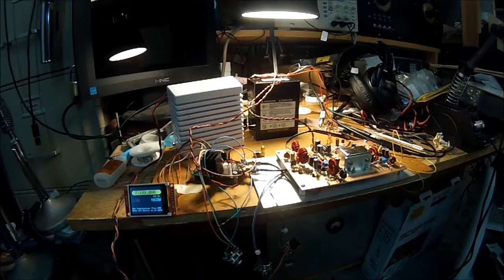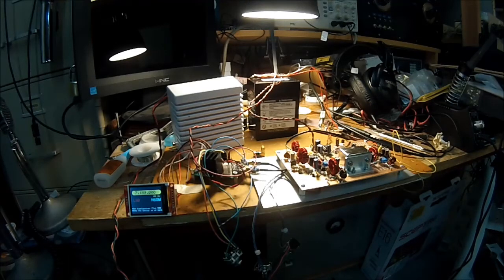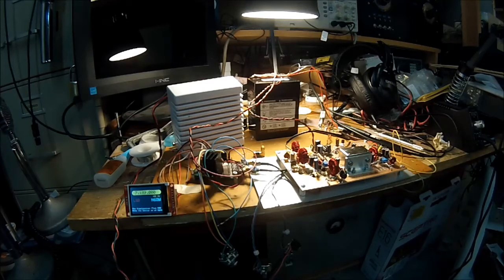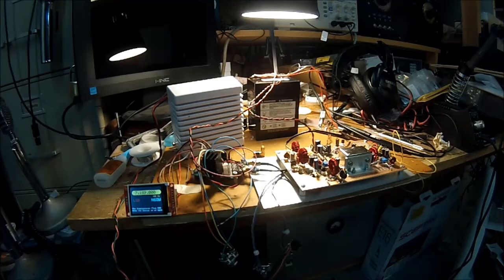So I'm encouraged. We got most of the circuitry on a single board. The upper board will have the switchable, and by the way, this is a single pass amplifier. We have a couple of relays here that enable us to essentially on transmit switch the signal direction so it passes through this way, and there's some coax underneath here that then brings it out into the mixer. And on receive it goes through single pass this way. Transmit it goes single pass this way. These two little relays here switch the signal, and we did that on the prototype, worked very well.